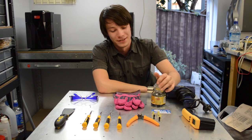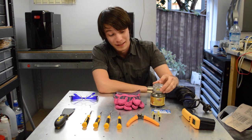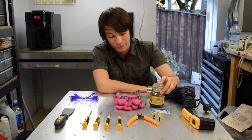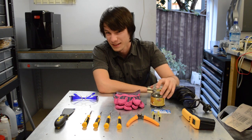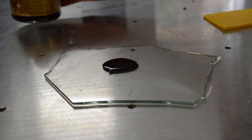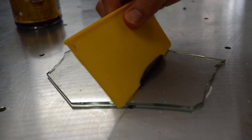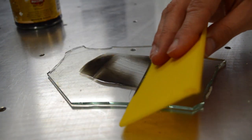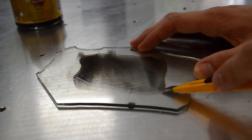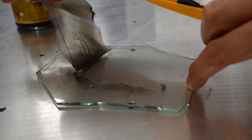Then we have ABS juice. ABS juice is literally just a mix of acetone and ABS — the exact quantities aren't important, you just want enough ABS mixed into the acetone so it's a little bit viscous. If you put this onto your print bed, it makes a huge difference to helping that first layer stick down and not warp. A good tip: apply ABS juice while the bed's cold, because if it gets hot, the acetone evaporates really fast and it gets hard to apply. Also be careful with the fumes and the flammability — it's quite flammable.